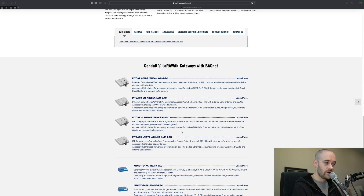The way LoRaWAN works, there are a few different frequencies that you could be using depending on where you are in the world. In North America, here in the United States, we're at 915 megahertz. So the two models on this list that we're most concerned about are the very top and the very bottom. That top one is going to be what we're using, which is just a straight-up Ethernet-based gateway to let you talk LoRaWAN through the air and then physically through Ethernet — directly hard connected into the gateway.